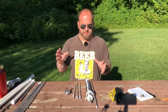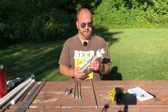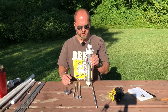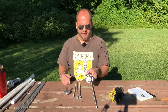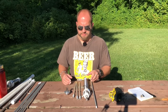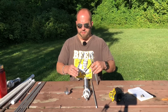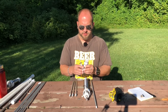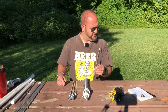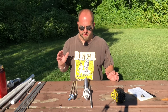The first one I bought was the Silver Bullet 1000 TIA — Take It Along. What that consists of is this 80 through 6 coil. The reason I got this, even though I'm never on 80, I wanted to have the option to get on it. So it comes with the coil, these three smaller tripod legs, your tripod base, a 102 inch whip, and three 33 foot counterpoise wires. I've worked all over the country with this antenna. It works fantastic and I love it.